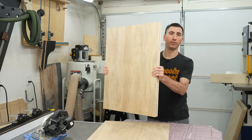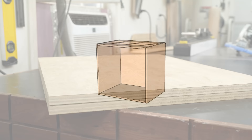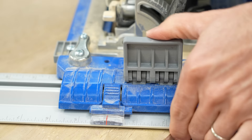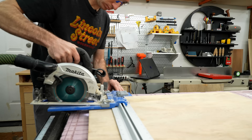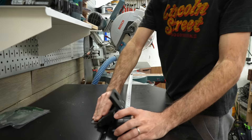If you're following along at home, great news — you now have two perfectly square cabinet sides, which means it's time to focus on the bottoms and top stretchers. That dimension is going to be completely dependent on your final cabinet width, so dealer's choice. However, it is mandatory to cut the parts at the same time so they will be identical, and I'll be using the miter saw and a stop block to get this done safely.